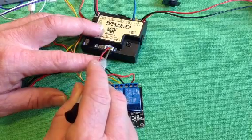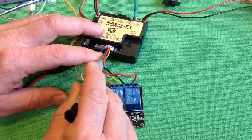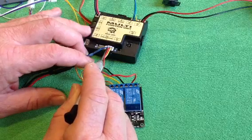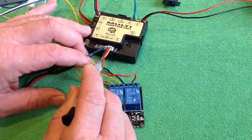How it basically works: you come in three from the right - one, two, three. This third pin in is your positive power supply. If you're going to switch both your headlight and your hull and turret machine guns, that's three things, so you'll need to split this wire into three.